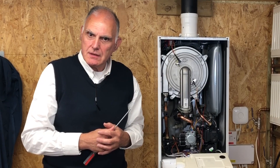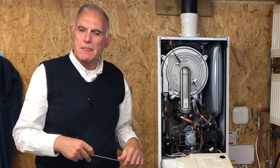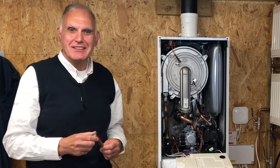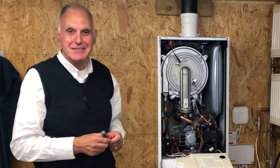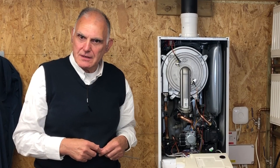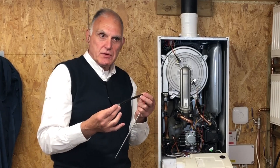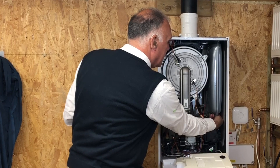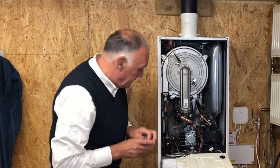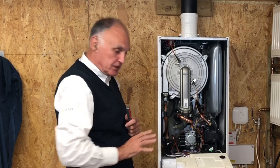Jonathan asks how long is the warranty? Warranty is seven years at the moment - warranty lengths do change but seven years at the moment. Fiber Washer just says cracking boiler, great to see David on video - I can't put a face to the name Fiber Washer, but thank you very much. Colin asks - the PRV and Schrader look a nightmare? No. First the Schrader valve: I often use an extension piece for charging vessels, but the valve is here so I can get my hand in there, undo that, screw that on, and then my pump goes on the side. The PRV is just here so I can pull that pin out by putting my hand in there, or you can take the side cheek off and get to it completely from the side.